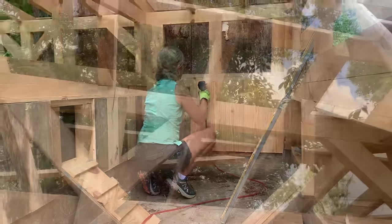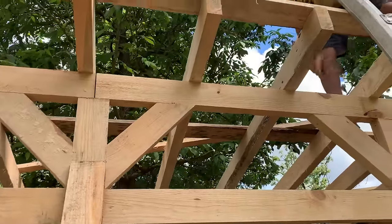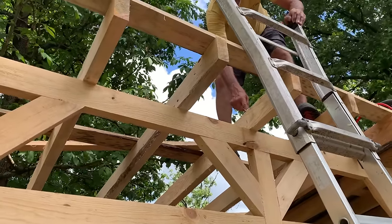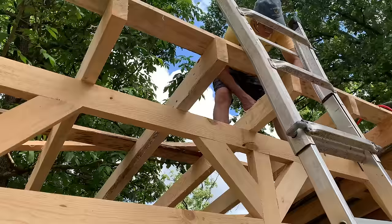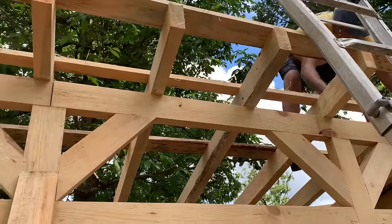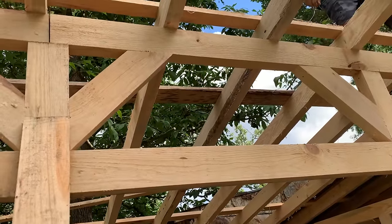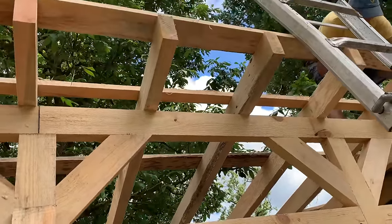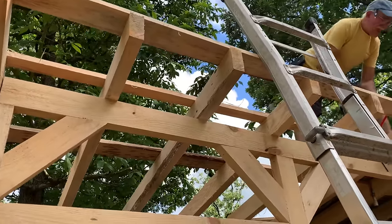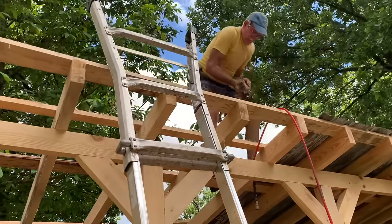One thing we forgot to do is right up on top of the wall, above the ceiling joists, we need to put a 1x2. You can see where he's pointing. That'll close off that gap when we get the blocking up under there, because those other 1x4s lift the tin up, and we don't want a gap anywhere. So critters won't get the chickens. Snakes. We have a lot of snakes here.